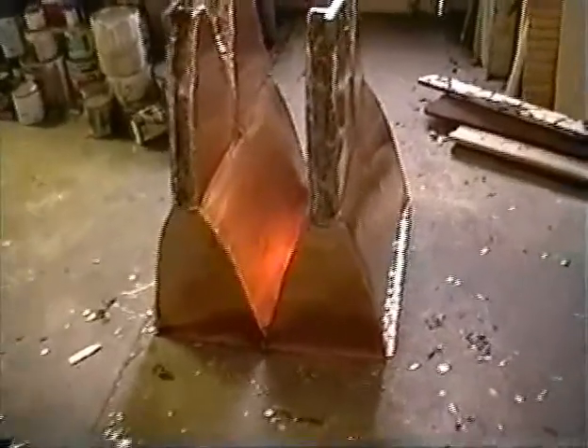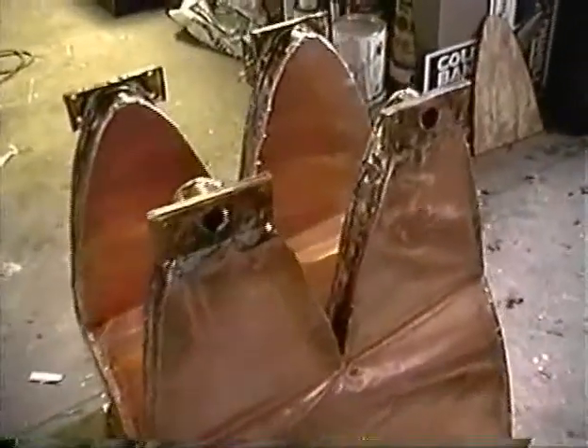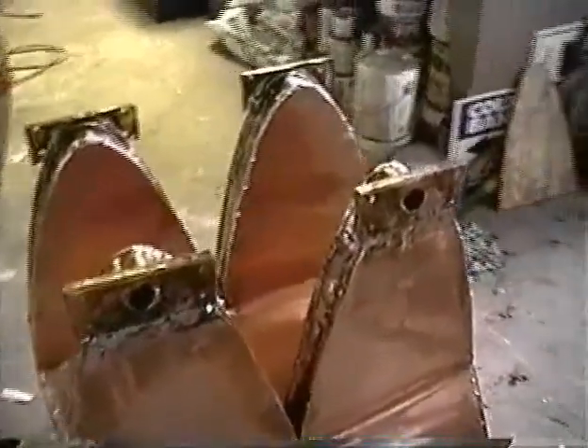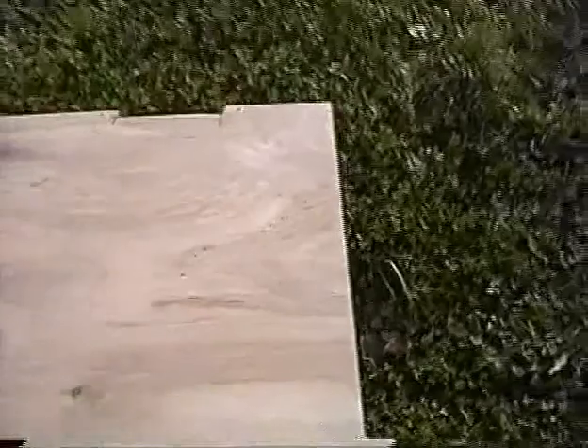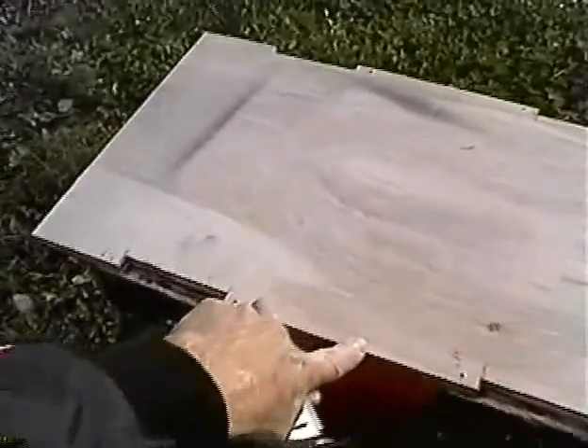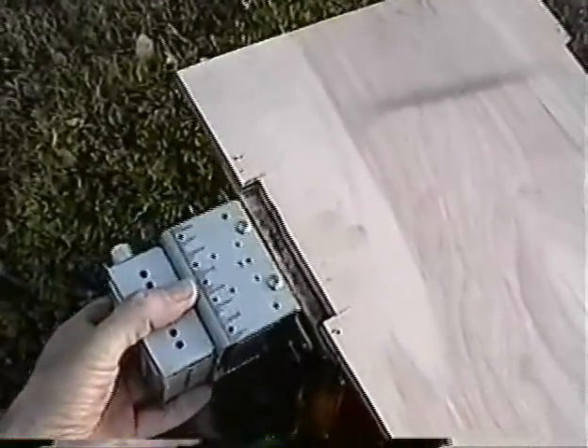Here is how it will look after it's built. You can see where the four magnetrons will be mounted. The structure is stabilized by mounting a piece of plywood 13 and a half inches wide by 24 inches long, with some notches that you might cut out to make room as you mount the individual magnetrons in their four holes.